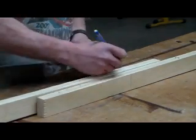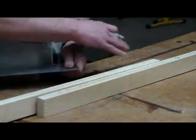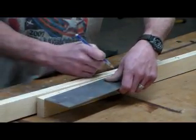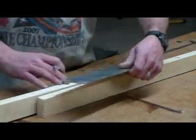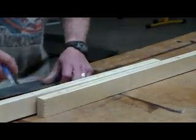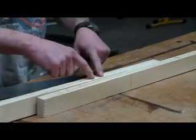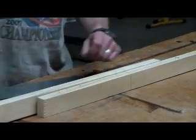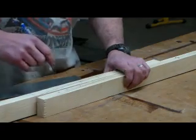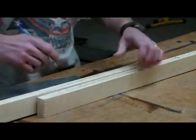There's a little bit of bad wood here, so I'm marking it in from that. I'm not using that part here. So we want to just mark where we're going to have a slope here. And this one's going to have the same slope. And then we're going to cut out this material, cut out this material. We're going to rough cut it with the bandsaw, and we'll finish cut it with the router jig that's in the plans and get a nice smooth finish and glue them up together.